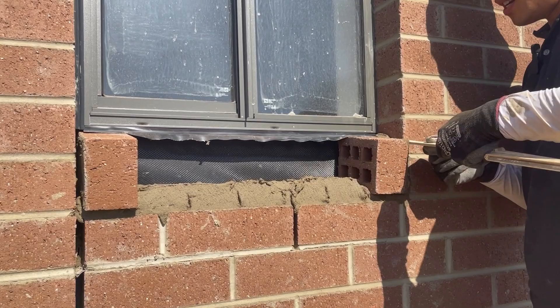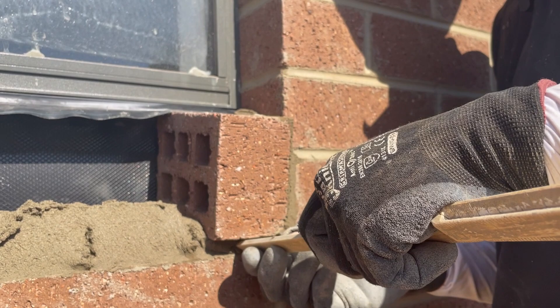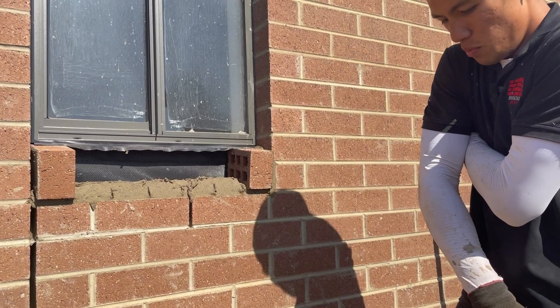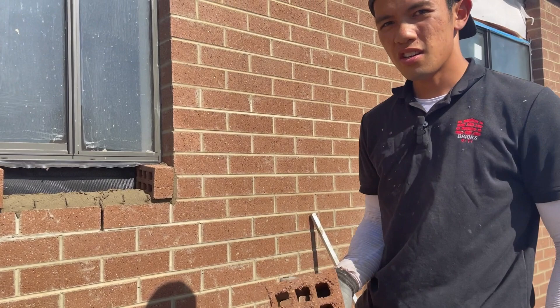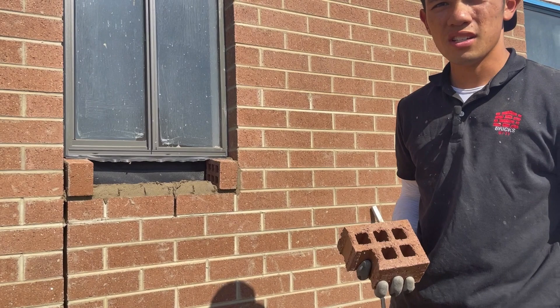It's just under 40 so I want to move it forward a bit, and on this side I want to move it to 20mm — so that's about 20 there. Both sides are now the same. All I need to do is put my remaining bricks in and make sure the joints are full. I'm going to butter all these sills — every person's different, but the bottom line is as long as the sills are full it doesn't really matter how you butter them.